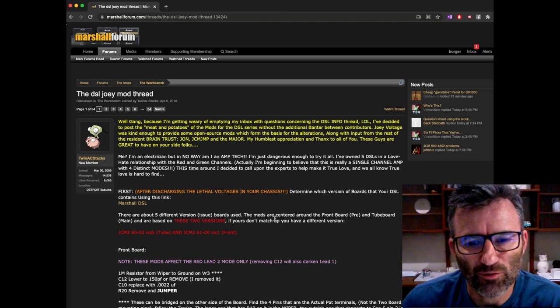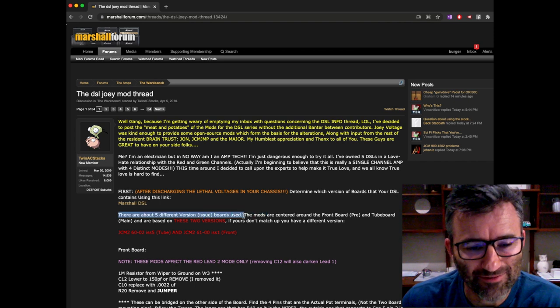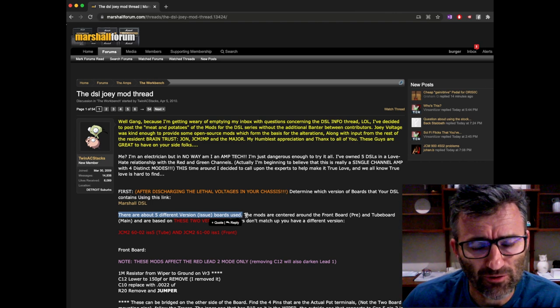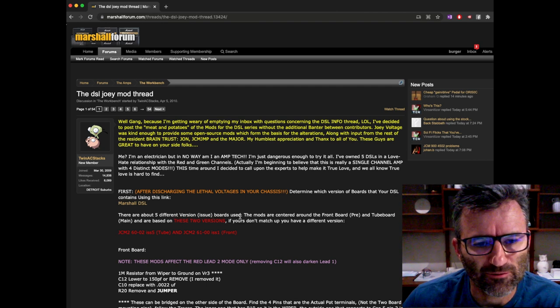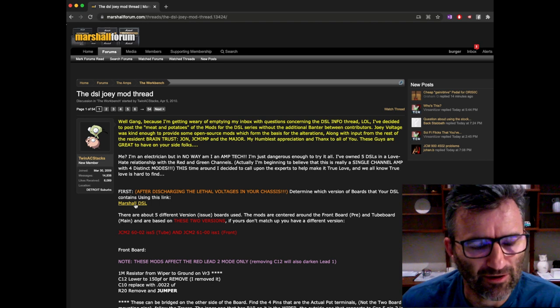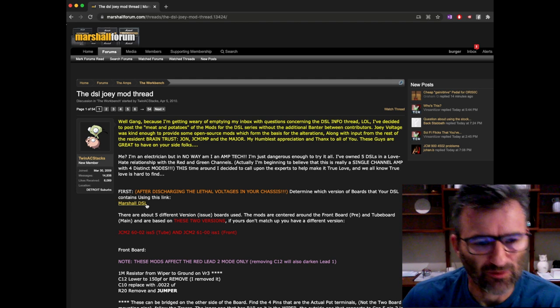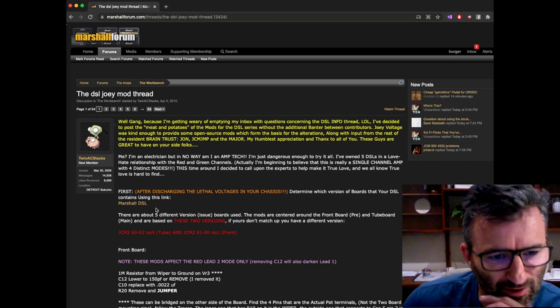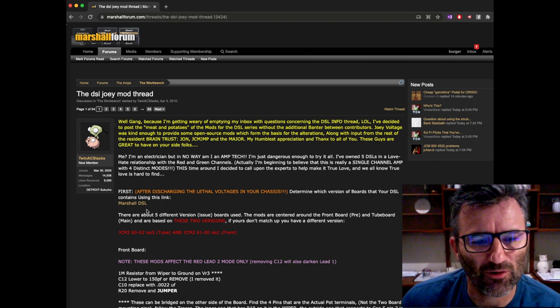And probably the most important thing here is this note, which says there's at least 5 different versions of the PCB used in the DSL100, right? So you've got the JCM 2000 series, now badged just as the DSL100. There are different versions of the board. So the one that I had in for modding, I had to go to this link here and basically find the schematic that matched the amp that I had, which I did from the version numbers and also just checking component by component. So I could look at the resistor value or capacitor value in a bunch of locations and match it against a schematic, and then I realized, yep, I've got the right one.